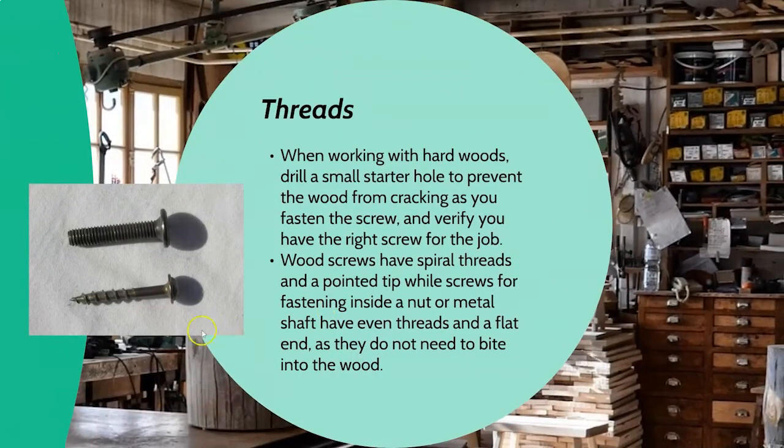Regarding threads: the pitch between the threads matters a lot. When working with wood, you'll usually have a wider pitch — a more defined thread at more of an angle — and that minimizes cracking as you drive the screw in. Wood screws usually have a pointed tip to bite into the wood, drywall, or material. Meanwhile, things with metal or applications needing a lot of mechanical advantage are going to have a smaller pitch — smaller distance between threads and many more of them. They'll often be more level too, because you want every single rotation multiplied and amplified to its maximum. So you need to know what material you're fastening to make sure you have the right screw.